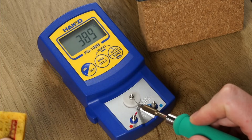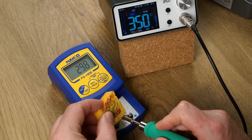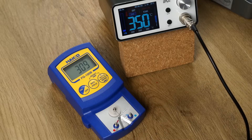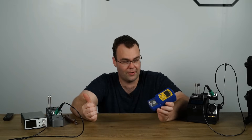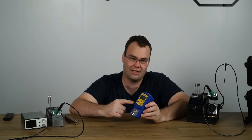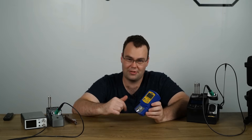Now it's time for the T3A. This had some spicy overshoot, reaching just over 50 degrees Celsius overshoot. Round two resulted in a more modest overshoot. So far we've collected good data on how both irons perform with regards to temperature, but one thing we can't test for with this is how much heat either of these irons can dump into your workpiece.